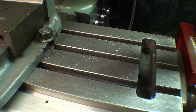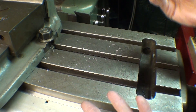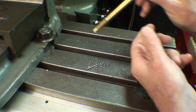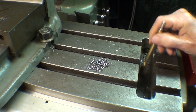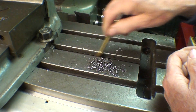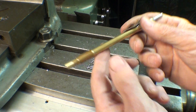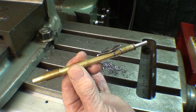Quite often, in addition to using a brush — and for you guys that are using air hoses, this doesn't really apply — but I don't like air hoses. You can get very easily into the T-slots. If you've got ten pounds of chips this might seem foolish, but generally you've done the majority of the cleaning and then you're trying to clean the swarf that's left in there. So that's the purpose of this: a retractable magnet, complete with pocket clip.